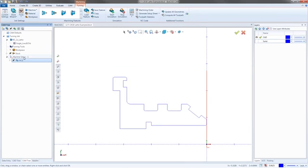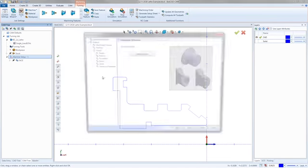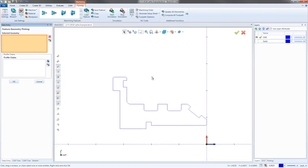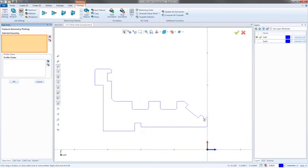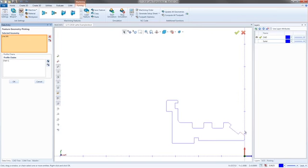So I'm going to now do the turn rough. So we're going to right-click here. We're going to go down to lathe turning and then select my geometry. Now for this one, I want to go just from this angle here, right there, to the back of this side here, to the back end of this. So what I want to do is I click on the first one, follow the chain all the way back till we find the midpoint of the last one.